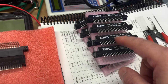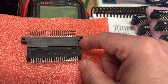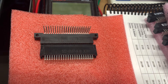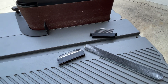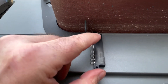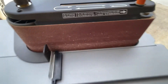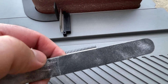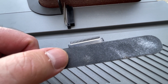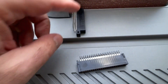So what I'm going to do is take these 10 EDAC ones, grind down these flanges on the side, and just for this one I might bevel the edges a little bit to see what we can do. The plan is to take the flange and sand it down against that edge. This is a very rough grit sandpaper — it's like 60 grit. When I finish them, I'm actually going to finish them with an emery board, which is basically equivalent to 220 or 240 grit sandpaper.